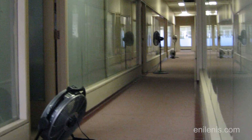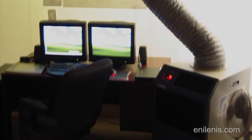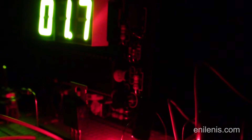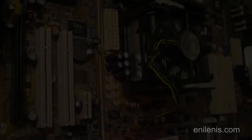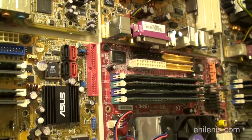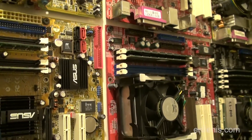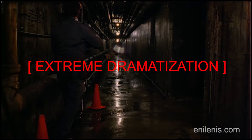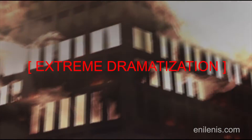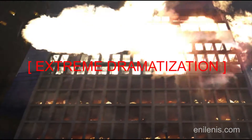In one of the offices where I worked, there was a problem with the air conditioning unit located in the server room. Every once in a while, the air filter would get clogged, and instead of cooling the equipment down, the air conditioner began to heat things up. The temperature in the server closet would rise by about 10 degrees Celsius per minute, eventually causing the equipment to overheat and crash. A server room you'll find in most visual effects studios houses the main server as well as the render farm — a cluster of computers designed to handle heavy calculations. It's critical to keep all of these components healthy and well ventilated, as they are the heart of every VFX operation. Our air conditioner did fail a few times. Sometimes it happened during the day when people were around to catch it; other times it happened during the off hours and caused many of the computers to fail.